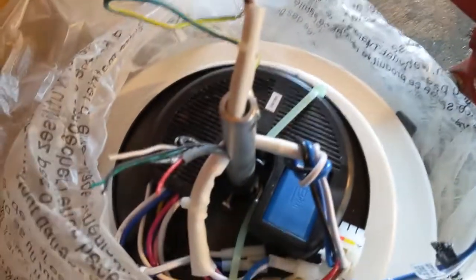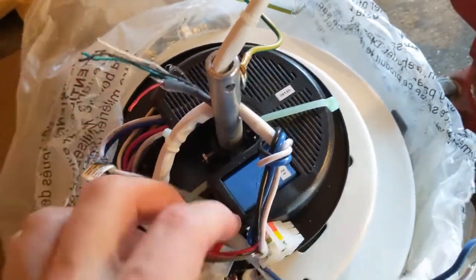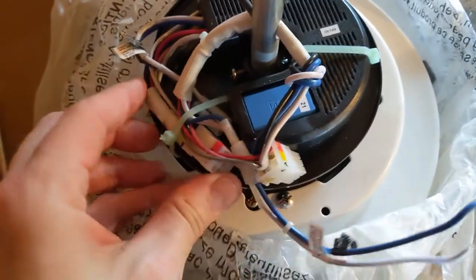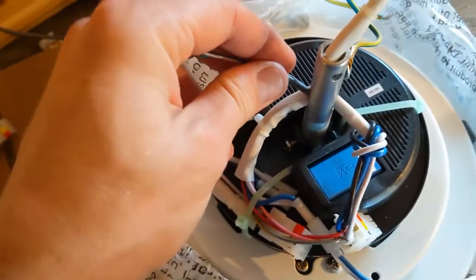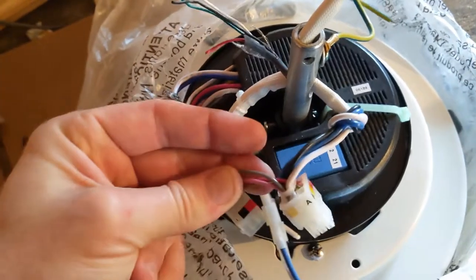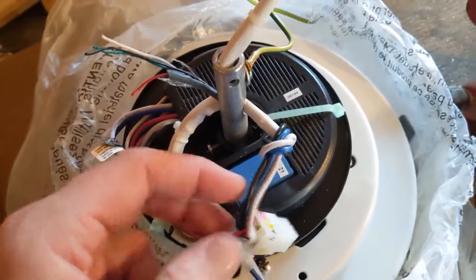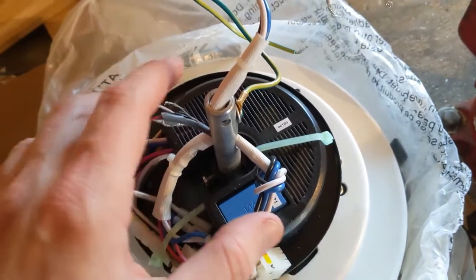Here's what it looks like on the other end, and this is the top that I took off right here. This is why they say that this controller is inaccessible in their model - just because it's a pain to get to. So I have a donor connector that I'm going to use. What it's going to do is I'm going to hook up wiring from here. Here are the coils right here from the switch that'll change the primary direction. I have to line it up - these are the primary and secondary winding coils - I have to wire it up. That's the diagram there.